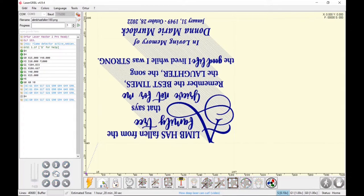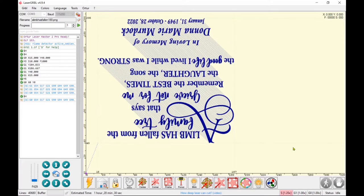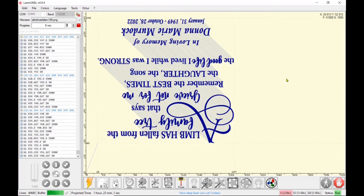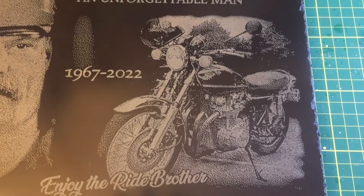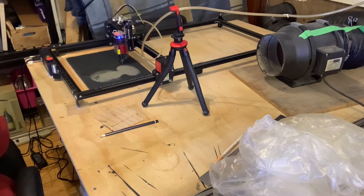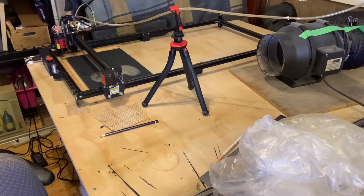I'm happy with my framing. I'll home the machine and before pressing play I'm going to go back to my slider tool and slide it over to 2x power. Of course I'm only using 90% max power, so 2x will only multiply up to what your laser is able to do — that's the 2x I used on both the photograph and the lettering. If you're underpowered your engraving will come out kind of a darker gold color. That's why I did line-to-line tracing for the lettering — I tried Jarvis first but the lettering had too many lines, so I switched to line-to-line tracing to get it crisp and clean.